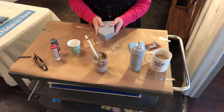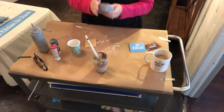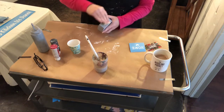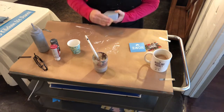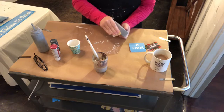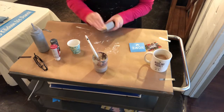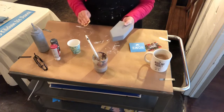I'm back. I let this dry completely, made myself a cup of coffee, so I am ready to go. It's completely dry — I even took the time and painted the back. Pick the side that you like the way it looks the most and take your little bit of sandpaper that comes with your sign and give it a good sanding. I really like to go on the edges and get the edges roughed up a little bit to make it look distressed — bring some of that wood grain back through. If you wanted to make it pretty distressed and have different colors show through, you could do a base coat of gray or black and then put white on top and sand it to have the bottom color come through. On this, I'm just making the wood grain come through.